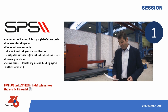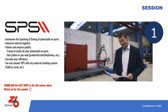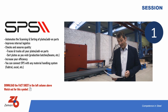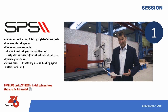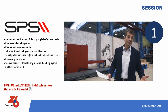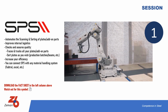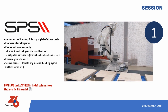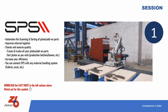Next question. Mattia, New Zealand, far away. We have two installations actually over there. Is it possible to search by part in the software to find its position? Yes, of course. We read the software drawing, Tekla, Advanced Steel, SDS2, and we know exactly what kind of plate goes where. So that's the beauty of that machine, that all the parts are clearly assigned from the drawing to the bins and no plate is lost.